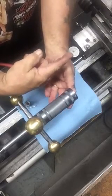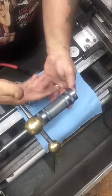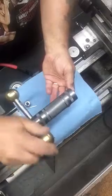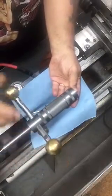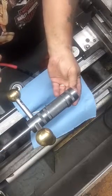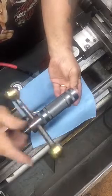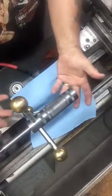You can slide this on, chuck up your rod or whatever you have in your chuck, lock your chuck down, then just run your tailstock up to it and you can start threading. It's very effective — works really well. It gives you nice straight threads with no chance of them walking off to the side and getting crooked.